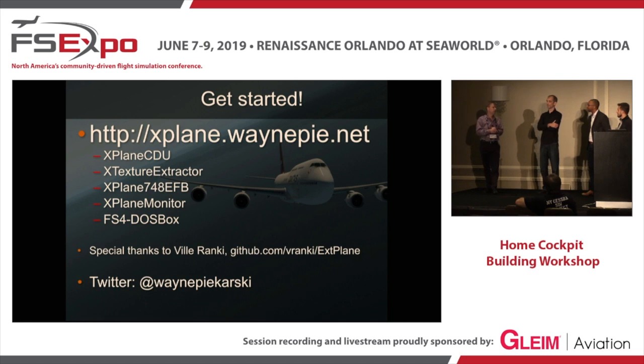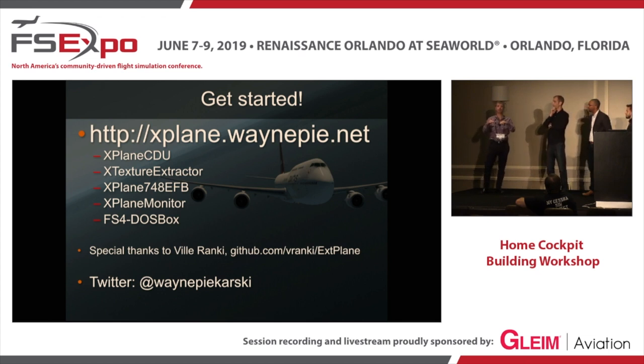And it gets really dangerous too. Oh, yeah. It's safe if you've just got a static platform. Once you've got hydraulics, I mean, if something fires wrong, if your software does something wrong, potentially you could throw people out or hurt someone. Yeah. And it's risky to start putting in crazy hydraulics that can pick up... I mean, how heavy is your nose cone? It's probably about 2,000 pounds. All right, so you're going to have hydraulics that can throw 2,000 pounds around? That's serious. And can do the heave, which is one of the motions, right? So you get into turbulence and you need to have it drop suddenly 3 feet. And so it's got to be able to catch 2,000 pounds after it drops 3 feet. So you've got to have a lot of confidence in that equipment. So personally, I don't really have any desire to do that.